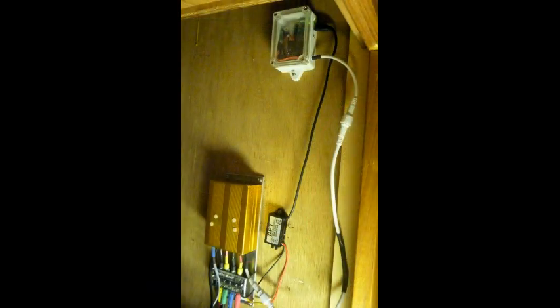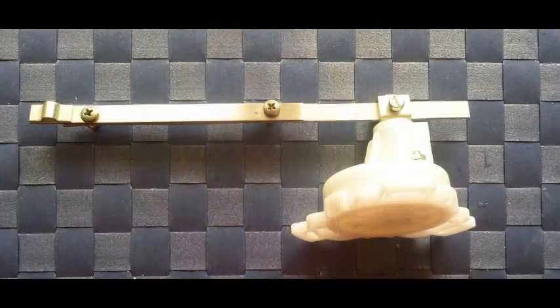The Raspberry Pi with the compass sensor should be mounted away from the controller to prevent the current-carrying wires from distorting the compass reading. An optional rudder feedback sensor measures the rudder position.